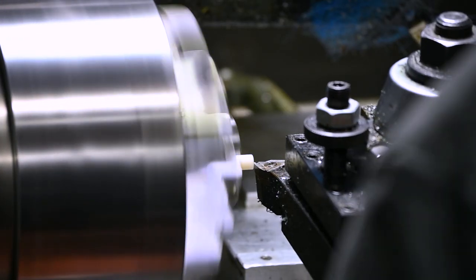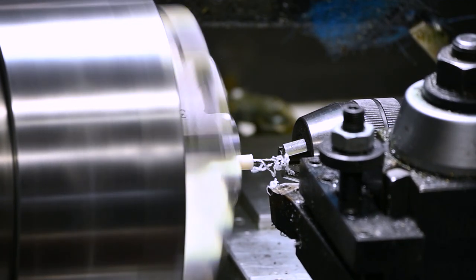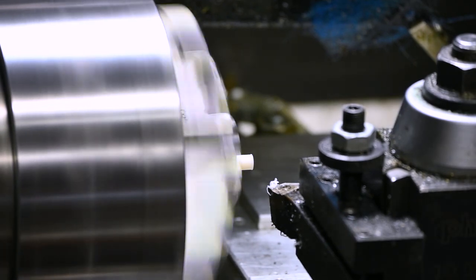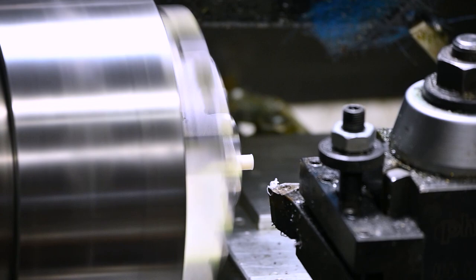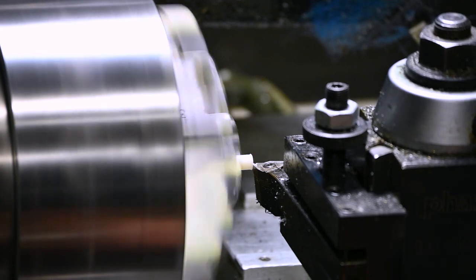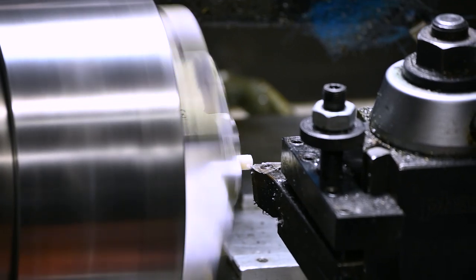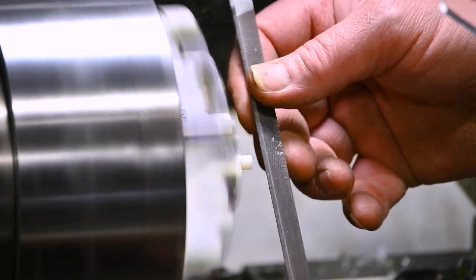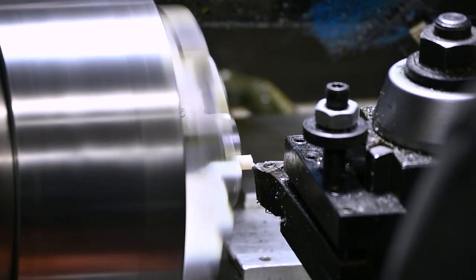And this deck is lacking the oil seal for the capstan, like most of them are, because they split and fall off. I was able to measure up one that I did find, and so I just duplicate those. And I've tried a couple of different materials, standard nylon and Delrin, acetal. What I finally settled on here was a static dissipating acetal, and not for that property, but some of the other properties of it should make it last a lot longer than the originals.